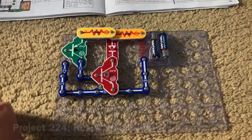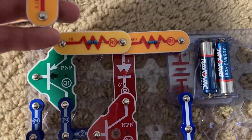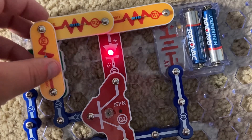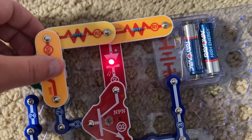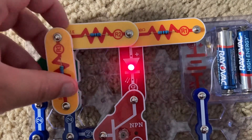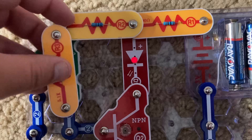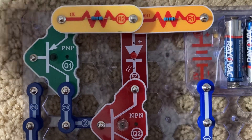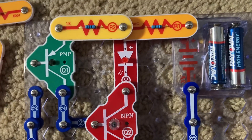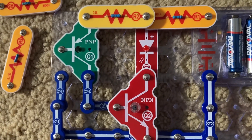Technicians call this contact resistance. For Resistance Meter, I am going to first place the R5 resistor between points R and Z — not snapping it in, just placing it across — and note the brightness of the red LED. Next, I'm going to press the R3 resistor above. The LED may actually get slightly brighter with the R3 resistor than the R5 resistor, despite the fact that R5 has more resistance. This is because the NPN amplifier receives more current at its input when the resistance is lower.